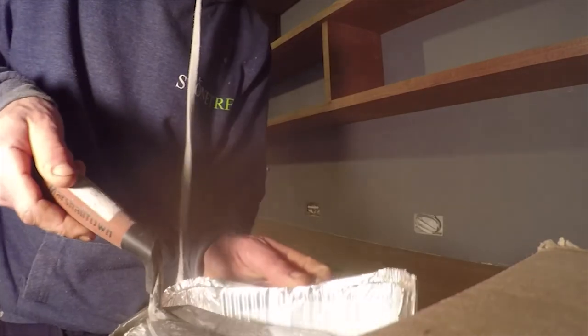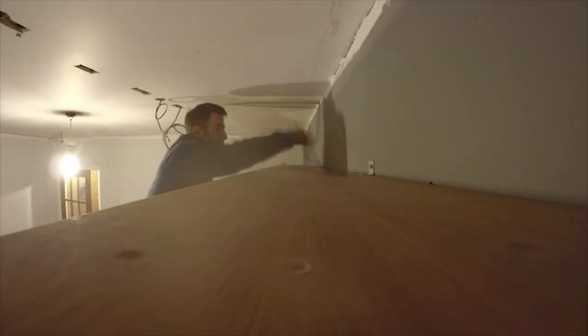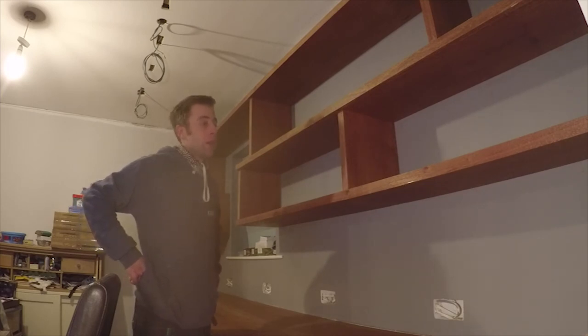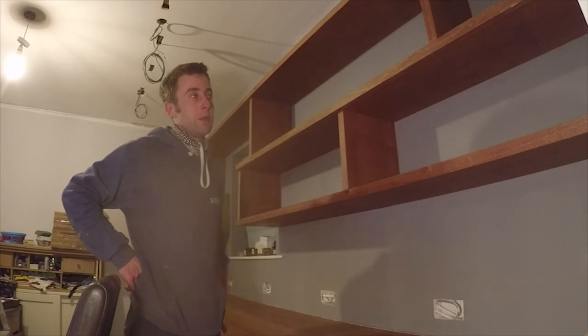Sort of this white stuff. I'm just going to use the brush to get it on. And I'll start in the corners. So that took about 3 hours, quite a bit longer than I thought it would. So we've just got to let it dry for at least, I think it's 6 to 8 hours. And then we'll give it a light sanding, and then we'll put another coat on. By giving it a light sanding, it means that the second coat finish evens out quite nicely.